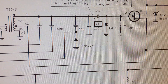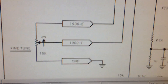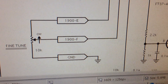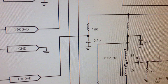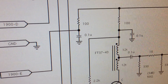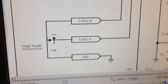You see there's a wire coming off the junction of the anode and the capacitor here, and that goes down to a potentiometer. You would connect the potentiometer to ground, and the other side of the potentiometer will go to a DC source. Here I have a 100 ohm resistor feeding from the power supply of the main oscillator, and a diode for filtering. Ideally, you could use a 10-turn potentiometer for more exacting adjustments.